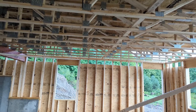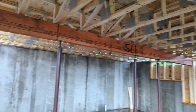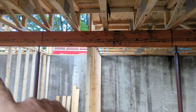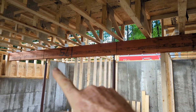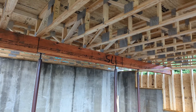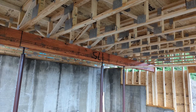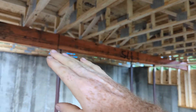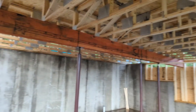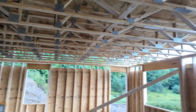So how do we do that? How do we distribute the load? Well, that LVL beam I just showed you spans this whole distance of 44 feet across, with those metal posts holding it up. That beam comes all the way across, which allows these floor trusses to cover that 22-foot span.